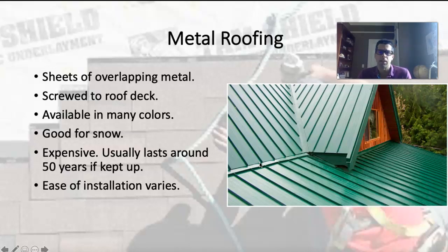However, I would argue that you actually want to leave the snow on your roof. Snow on your roof is an added layer of insulation — it's akin to building an igloo. Installing metal roofing can be easy or hard, mostly depending on how steep the roof is. One of my complaints is it's really hard to walk on — it gets really, really slippery. Any amount of moisture or dirt and you're basically walking up a slide. You get accustomed to walking certain pitches on asphalt or wood shingle roofs, and then you try the same pitch on metal and you're going to slide off and fall. It can be a lot more dangerous depending on the steepness.